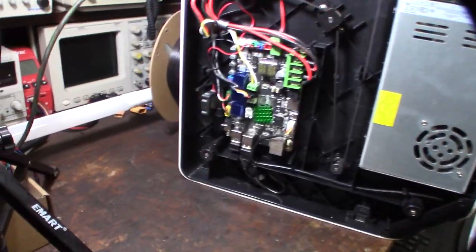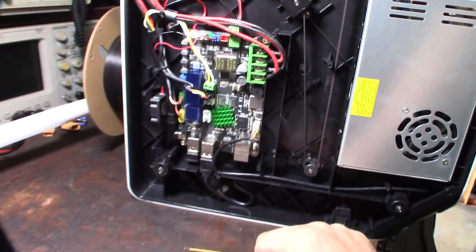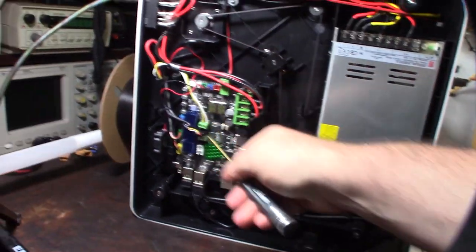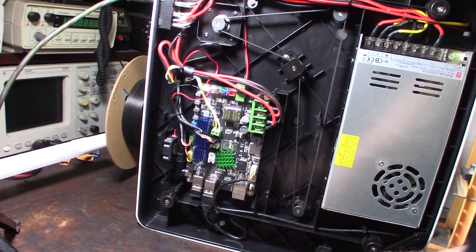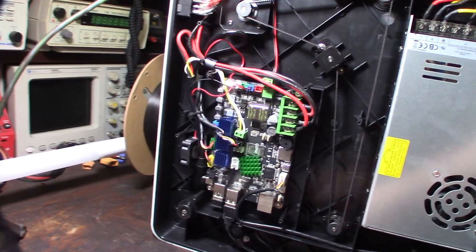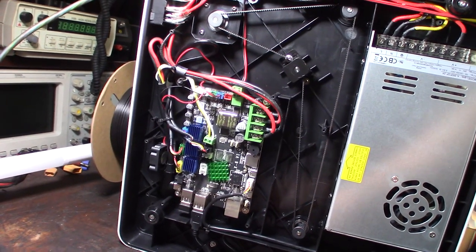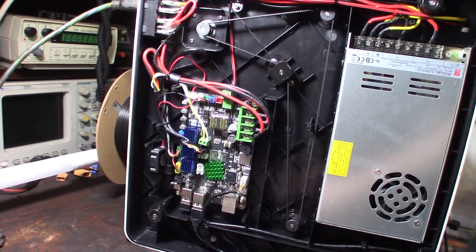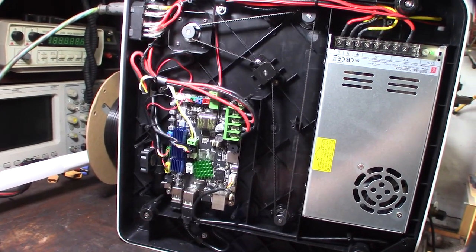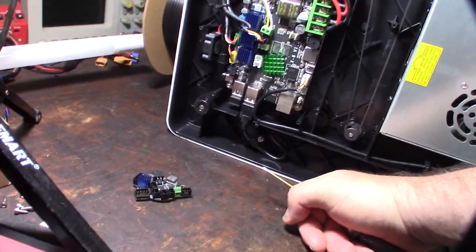Here's the main board — it's basically an SBC (single board computer) and MCU all-in-one, like a Raspberry Pi integrated with a 3D printer board. It's made by MKS but it's not a Skipr. It only has three TMC2209 drivers: X, Y for the Core XY, and Z. The extruder runs off a tool head with an accelerometer — a CAN bus tool board, similar to the BTT EBB36.